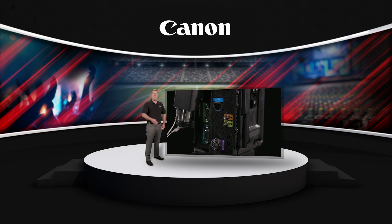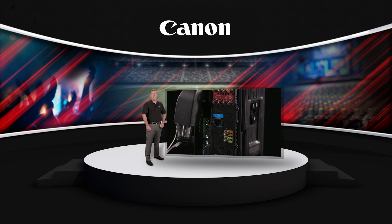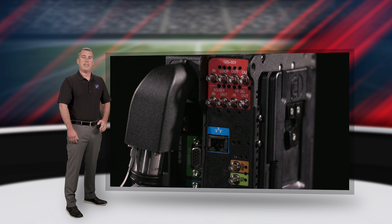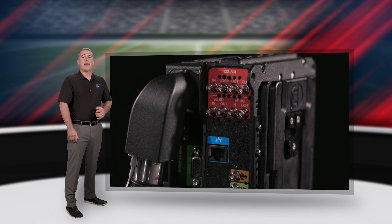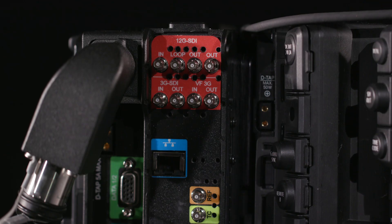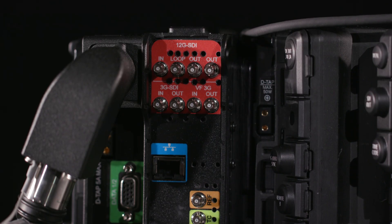The Silverback VB comes in four different video I/O configurations. There are two HD-capable versions: the most basic provides one 3G SDI in each direction, and the next version up supports two 3G SDIs in each direction. The basic 4K model handles a single 12G SDI in each direction, while the 4K version shown here also sends a 3G SDI in each direction in addition to the 12G SDIs.